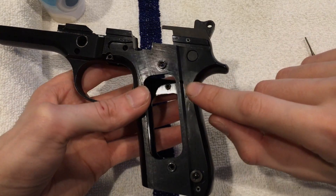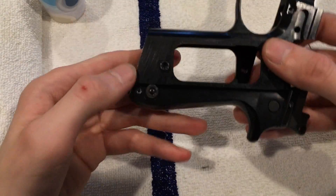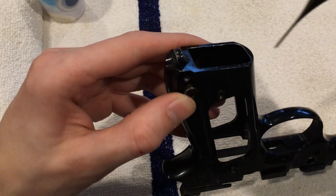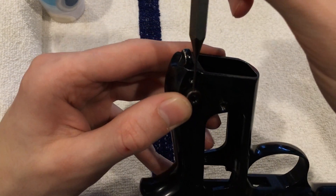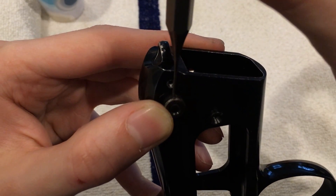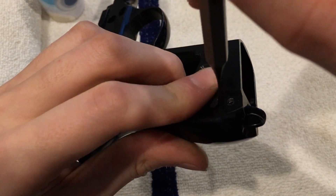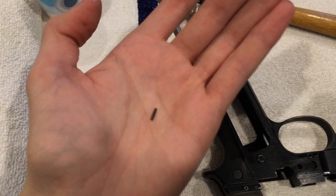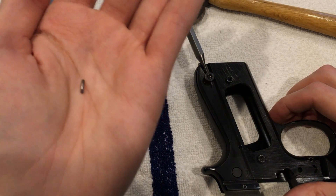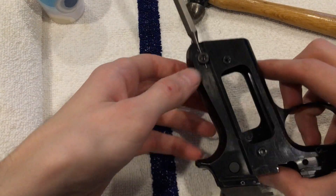Our next step, in order to remove the hammer spring located in the frame, we're going to have to remove the European style magazine release button. I urge you to proceed with caution because reinstalling this is very difficult. There is a very small pin here — you're going to hammer that out. This is under spring tension. The pin you just hammered out is very small and very expensive to replace if you bend or break it trying to reinstall it. Take care and caution.